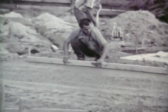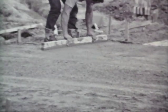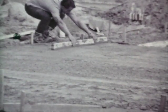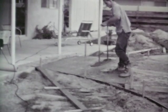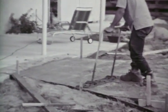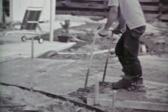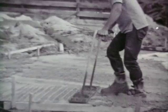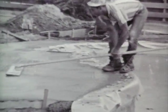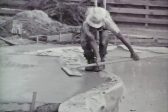Striking off concrete, no allowance is required for Kool Deck topping. Normal shrinkage is sufficient. The 1/8 inch application will be level with coping. After raking concrete into place and leveling, tamp sufficient fat to surface. Use a bull float to remove tamp marks.